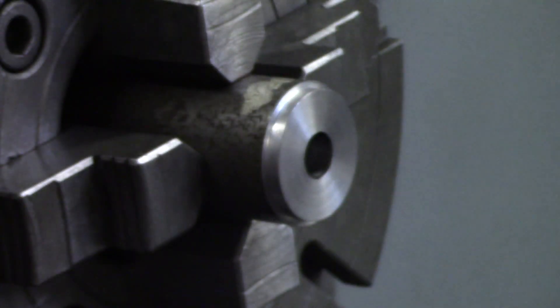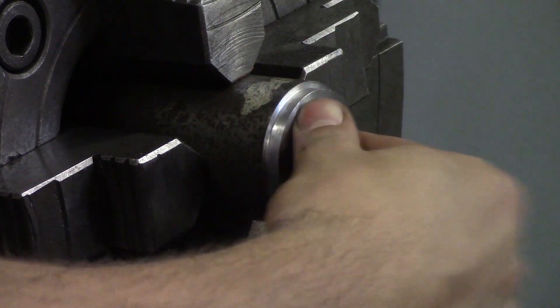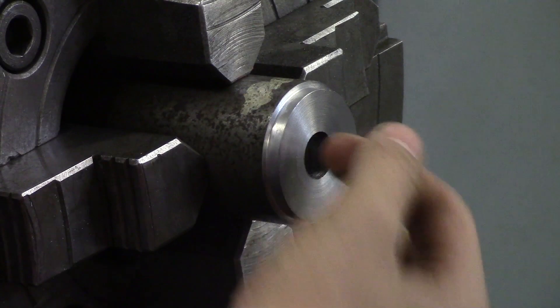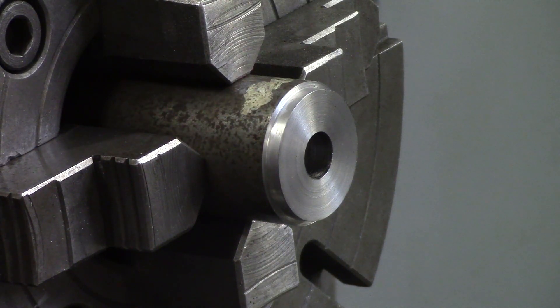There are a couple of different ways to bore. You can step bore: if you have a two-inch deep hole and a small boring bar, don't go the full two inches at once because chips will load up and may chip your insert. Instead, step down one inch, bore out that inch to within about 10 thou, leaving a finish pass, then clean it out and take another inch. You could take half-inch increments — that prevents chips from building up at the bottom of your hole.